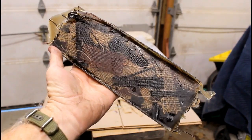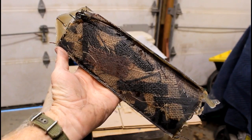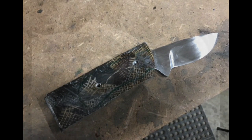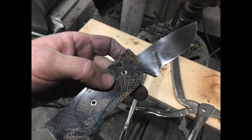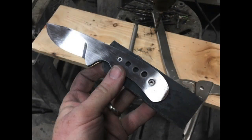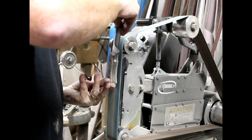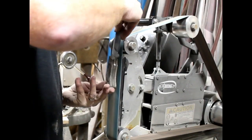You can see all the different colors of the burlap. I started the process — this particular knife is a small AEBL stainless steel blade. I decided to use removable scales; I had done this once before. My friend Steve Graham told me how to do it, and I really like the way the black cap screws are going to look with the micarta handles. Otherwise I would normally glue the scales in place onto the knife blank and pin them, but for this particular knife I used removable hardware, and I'm very happy I did so.